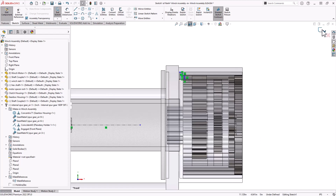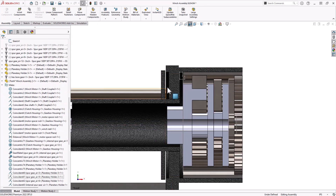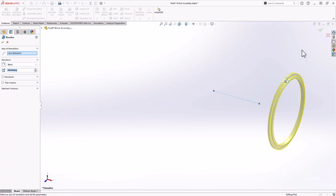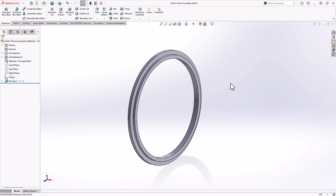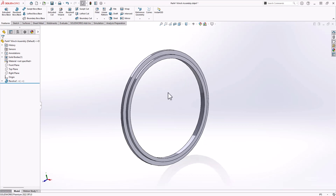The shim looked about like this — a nice little stepped shim to sit in that gear, hold it in place, and shim it up against the part. This gearbox gets hot and it's got grease in it, so I need a part that can withstand that. It also needs to be high-tolerance both in diameter and thickness. It's really thin and almost delicate. I was looking at cutting it on a lathe, but it's four inches in diameter and really thin — potentially easy to break. I thought about a sheet metal mill or finding a washer, but there was nothing good until I thought about additive manufacturing.